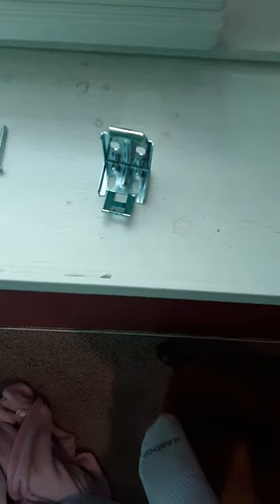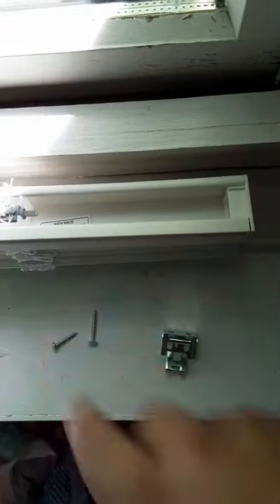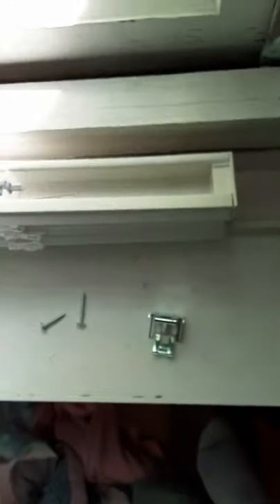Here's what our bracket mount looks like — that's what we're going to be installing. There are three of them and they come with the screws. Looking at the inside of the blind at the top, we don't want to install the bracket mounts where there are inner workings, so we won't go too far from the edges. There's something right in the middle, so we'll go a little bit left of that for the center bracket.